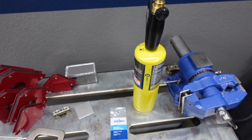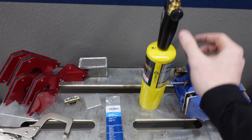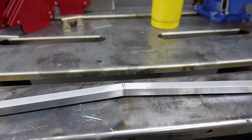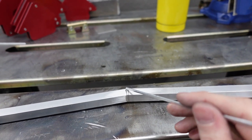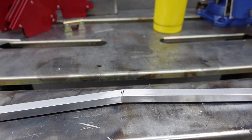While that's drying we're going to start fabricating our front grille. I'm going to use this torch and this brazing rod and we're going to be doing a little bit of melting of the metal — nothing too serious. The brazing rod can be found at Lowe's for five dollars and the torch for fifty dollars. Brazing metal is super easy: all you have to do is heat this metal to above 700 degrees — because this rod melts at 700 degrees and the aluminum melts at 1200 degrees, so it's pretty foolproof. Heat it up and when it's over 700 just put it in the joint and it's going to melt down there, giving us a little bit of extra security so nothing breaks loose.